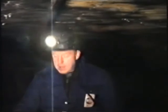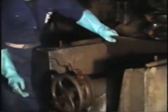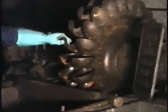And we see also the continuation of the compressed air pipes again. This is the continuation of the water system. As you can see, we have a valve with the large pipe coming up. What this actually does, we have a 3-foot diameter Pelton wheel here, which powered a Broom and Wade compressor.